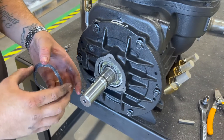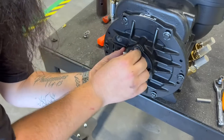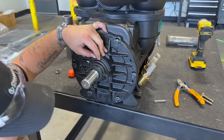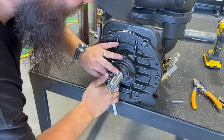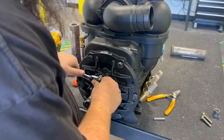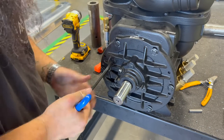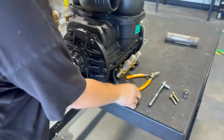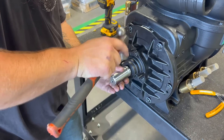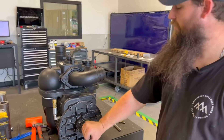Make sure that snap ring is seated in place. Rotor spins — put our wave ring back in there. This flange right at the top has a grease zerk — that's how we're going to assemble it. That's going to be our metric 10 socket. Now we're going to reinstall our port — you have a crush washer. We'll reinstall our key. Now that we've got our pump put all back together, shaft spins freely — it's good to go.